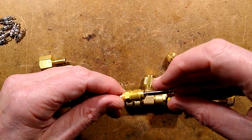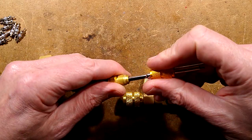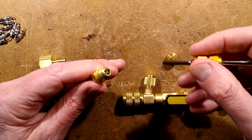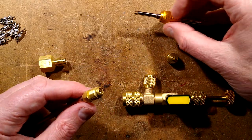However, if it's under pressure, you can't really do that. If it was under vacuum, it would be pulling air in — which is bad — air and moisture. And if it was under pressure as opposed to vacuum, it would potentially be blowing refrigerant out, which would be very expensive indeed.